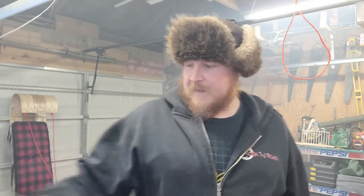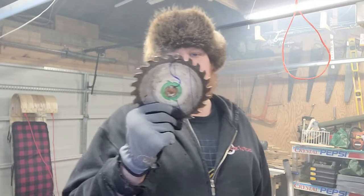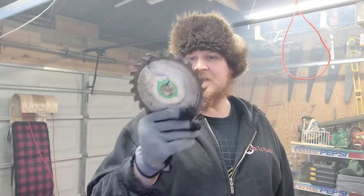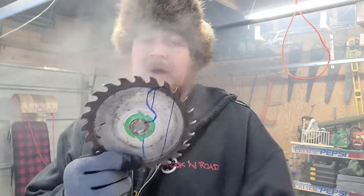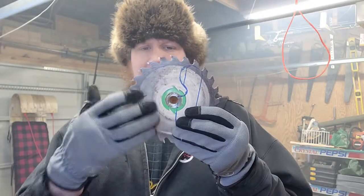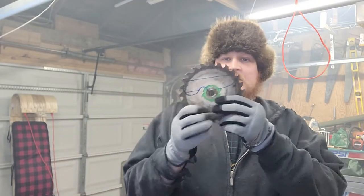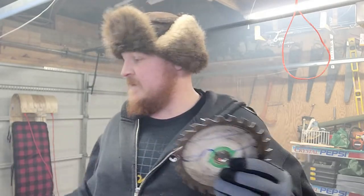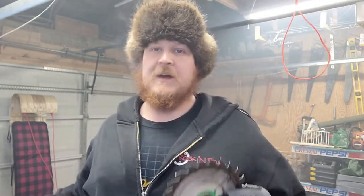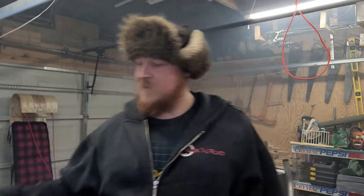The most important thing about this — because we're not heating this up with a torch to harden it, we're not going to anneal it — but basically what we do want to make sure is that this doesn't get too hot. This blade is already hardened, so you can get a razor-sharp knife out of it if you're just very, very careful. As you go through this process, you're going to want to put it in water and cool it down periodically. I've got a luxury right now — I've got lots of snow, so that's what I'm going to use.